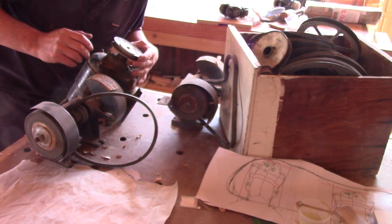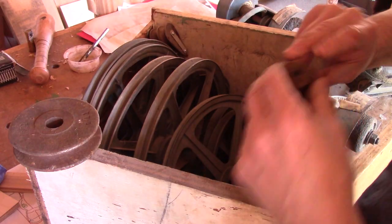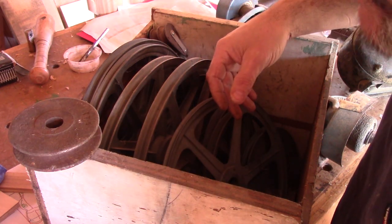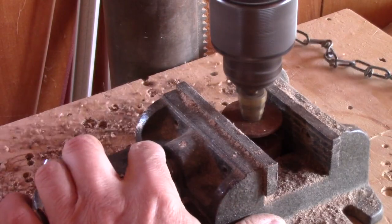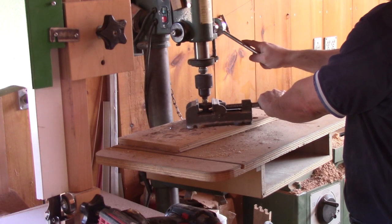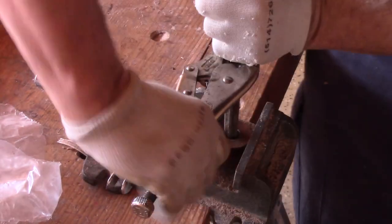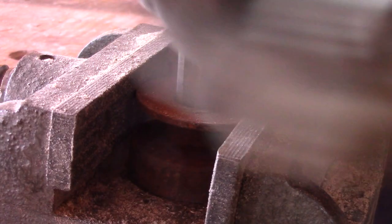Yes, to reduce despair I keep a lot of stuff just in case — and here I'm pretty glad I have those. I look into the surprise box to find the smallest pulley I have. I found two, but their holes are way too small. I drill a bigger hole with a step bit, drilling from both sides. Since I now have a hole with the center too small, I use one of my grandfather's reamers to enlarge it. This really does a great job and in no time I'm finished.